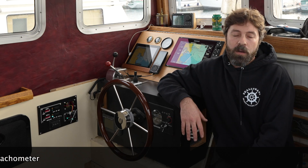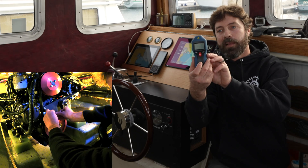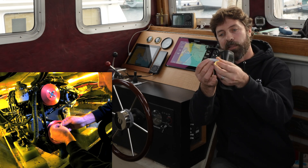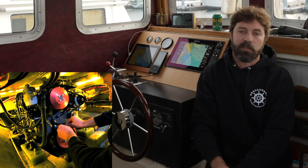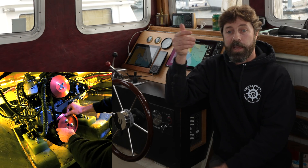The first step is to confirm what our actual RPM is. To do that, we just go down to the engine room using one of these little photo tachometers. These always come with little reflective tape. You just cut a little square of this — it's sticky back — and you're going to put that on your crankshaft pulley. Find your crankshaft pulley; on pretty much any engine it's going to be the middle lower pulley. Stick the piece of tape on that pulley, crank up the engine, rev it up, try to go mid-range RPM — 1500, 2000, something like that — and get a good reading on what you're actually at.